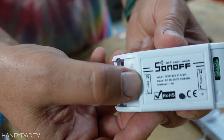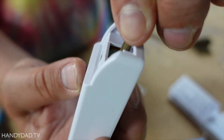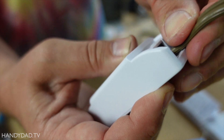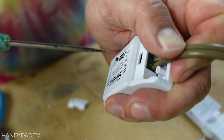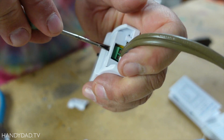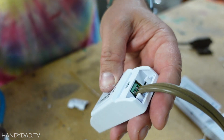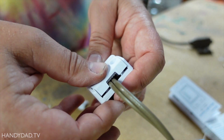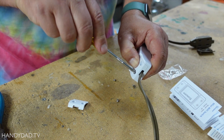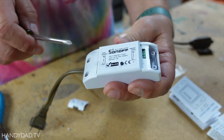Make sure you're looking at the input side — it should say input on it. Push the wires in as good as you can. You don't want any wires crossing over between terminals, otherwise that'll cause a short. Push them in as far as they'll go and use the little screwdriver to tighten it down. Get them good and tight, and then the strain relief goes on. That's the input side done.